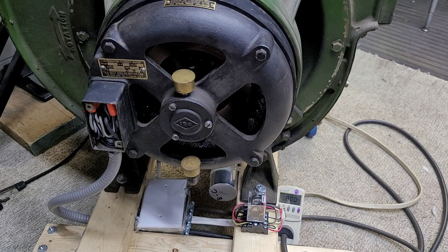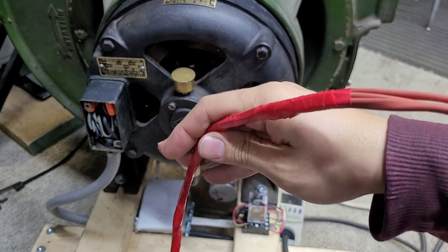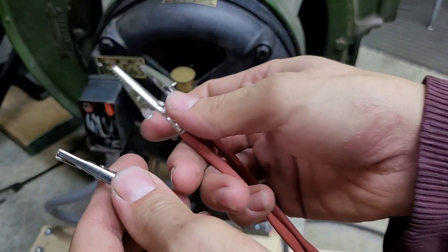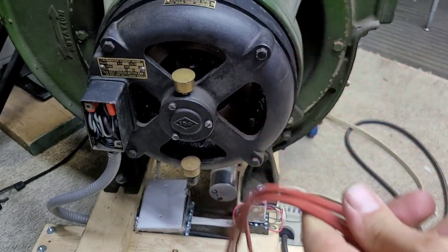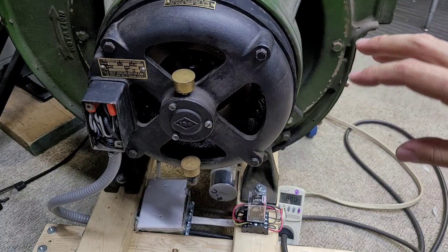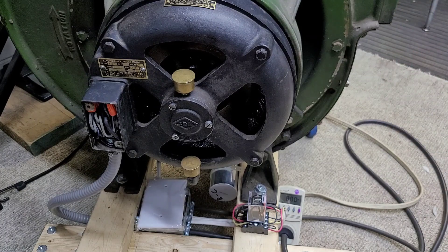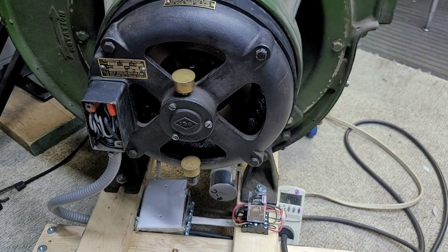This thing really works good. I'm very satisfied with the phase balancing. I have a three phase voltage meter — and I know it looks homemade with the electrical tape wrapped around and the heat shrink and everything — but I have alligator clips on the end and I can just attach these to the three phases on whatever I want to check. I can see the balance between the three phases all at one time in live time. So if I'm changing capacitors and I want to alter the capacitance between two of the phases slightly, I can watch in live time as I change it and see what these voltages do, and really try to get the capacitors as balanced as possible so those voltages are nice and even.